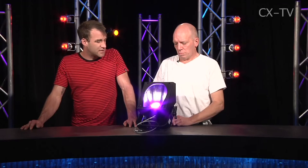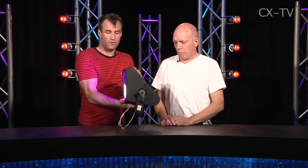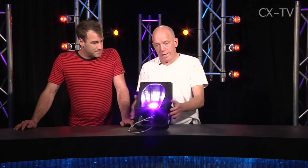If you're going to go more than five meters in height, you probably need to go for a ground row. To run ground row, you just spin the yoke around — and interestingly, it doesn't actually point flat against the cyc; it points with the back face parallel to the cyc side, and that's what gives you that nice even projection because of the design of the reflectors. And it's designed and built in New Zealand — go the Kiwis! PL Cyc1.